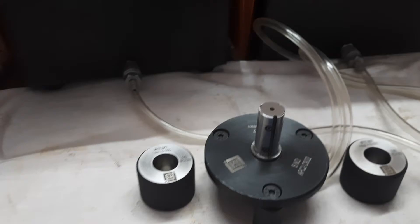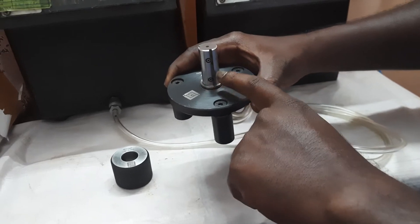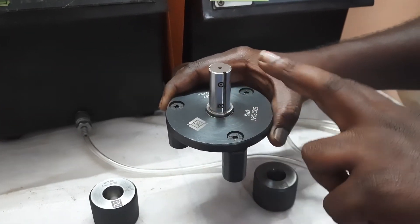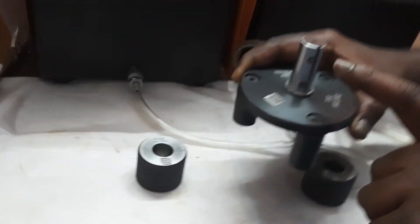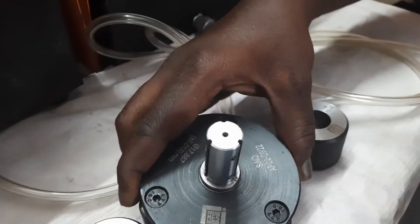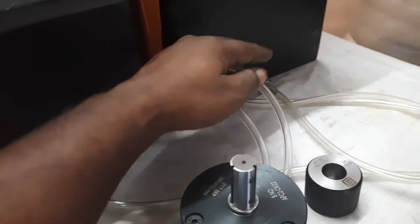At the end of the day, by using this plug we can measure diameter 1 and diameter 2. The difference between diameter 1 and diameter 2 means taper — calculating taper is also possible. By using diameter 1 and diameter 2 we can measure the taper, and lobeing we can also observe.